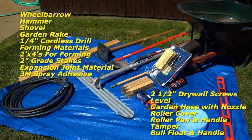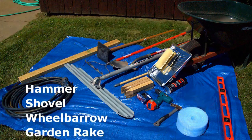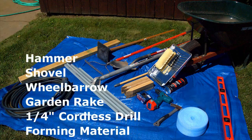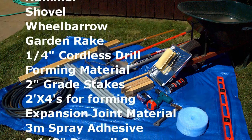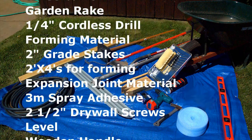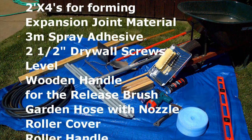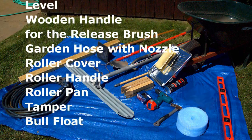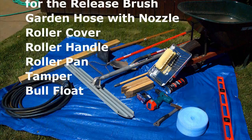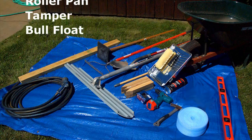DIY Stampcrete provided a detailed list of the other items they'd need. A lot of them they already had. Hammer, shovel, wheelbarrows, garden rake, quarter-inch cordless drill, forming materials, 2-inch grade stakes, 2x4s for forming, expansion joint material, 3M spray adhesive, 2.5-inch drywall screws, level, a wooden handle for the release brush, a garden hose with a nozzle, roller cover and handle, a roller pan, and a tamper. Now they need a bull float. That can be rented or bought.